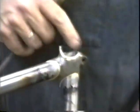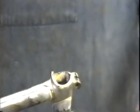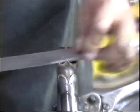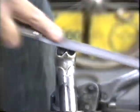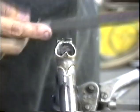We're going to clean up this area. As you may recall earlier, we cleaned off this piece of scrap up here with the grinder, and now we're going to finish by doing some filing. I'll be using mostly a 6-inch and 8-inch Nicholson half round. Basically here we're just going to make sure that the lug and the tube are exactly the same length, so the tube ends just where the lug ends. The two of them should disappear into one piece.